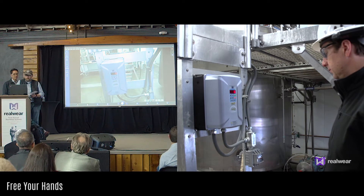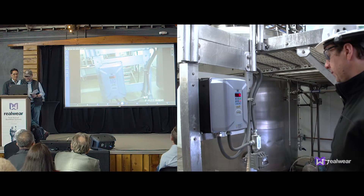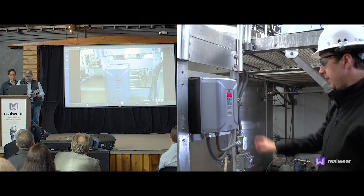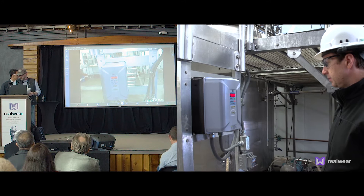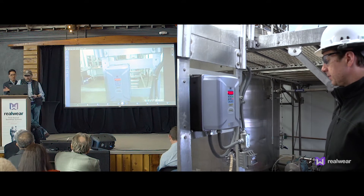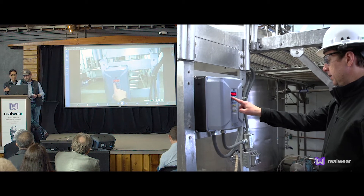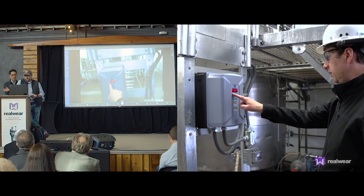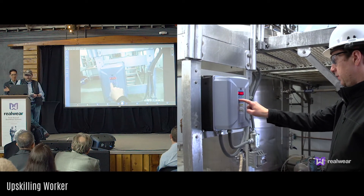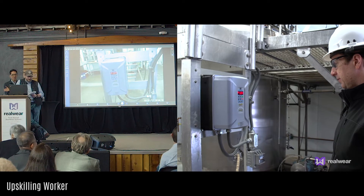They're showing six, so if you could down arrow one time for me. Oh yeah, my mistake, sorry. No worries. You want to hit the program button one more time for me? Now we're going to set the maximum frequency of how fast this pump is going to spin. Use the up arrow key and you want the display to read P134. This is my first day on the job, so excuse me if I get it wrong. You're doing great. You sailed right by 134 there. 134 — there we go. Go ahead and hit program.